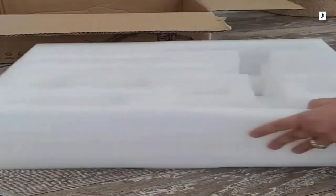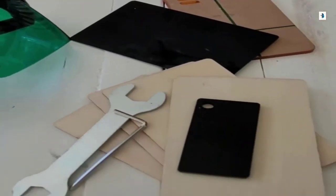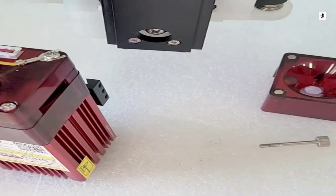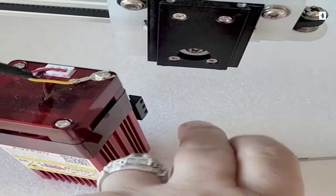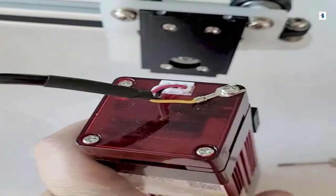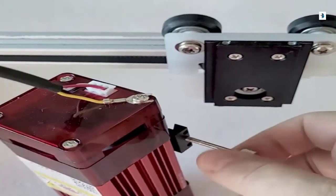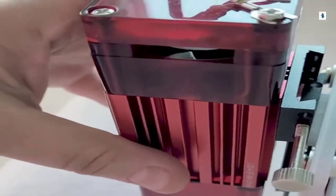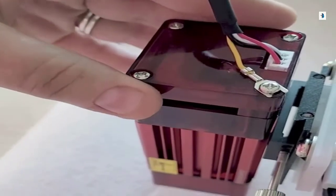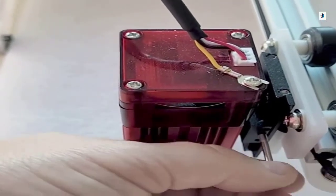We're almost there. Ta-da! Look how cute it is! Looks like the company also included some materials to practice on, which is great. Because it came pre-assembled, all we had to do was attach the little yellow wire and the white wire and put the laser head on. Next, we're just going to screw in the little piece here — this is our little focus tool. We're going to slide this onto the rail and we're ready to get started. We're going to set the focus like that and once we get it where we need it, we're just going to tighten it down.